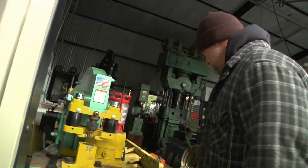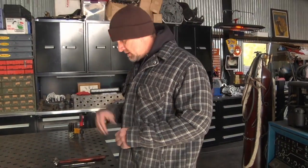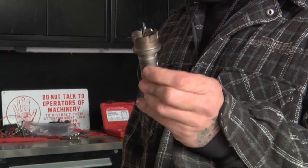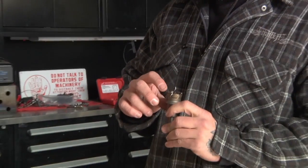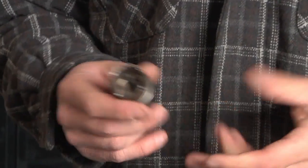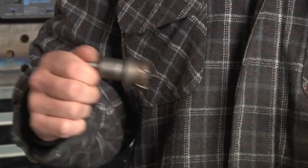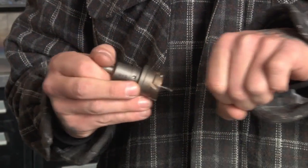I see a lot of guys having problems where they can't cut holes, or make a round hole in sheet metal, or you have to have it machined on a turntable or whatever. What I use, which has been a trick for years, is rotary broaches, and this is just a Milwaukee broach, and it has a carbide tip on it. This is for electrical contractors, when they need to put a hole in the side of an electrical box. They use these broaches to cut a perfect hole, and then they have the little clamp that grabs the wire and then sets itself inside the hole. But these things are super durable and pretty precise.